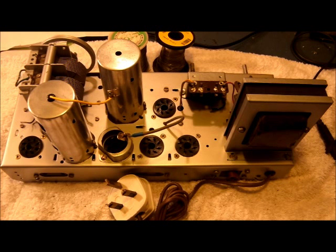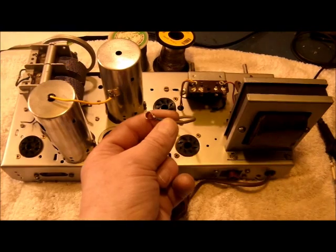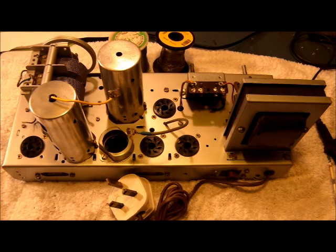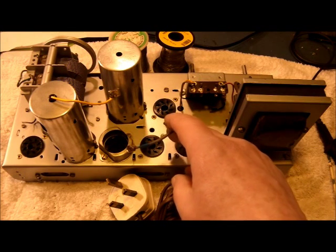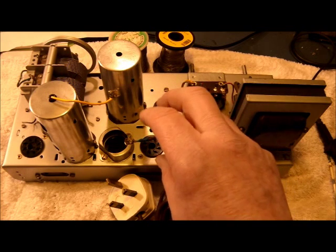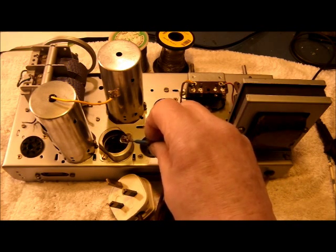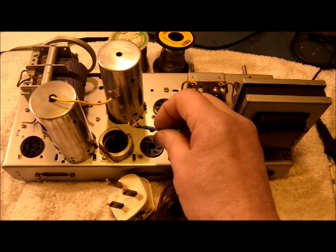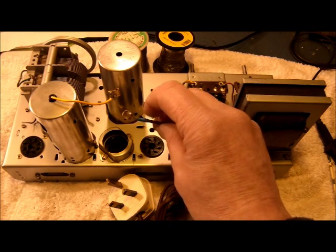Just a couple of small tips: it is essential to clean and shine valve pins and valve base connecting forks. It is also essential to clean and shine valve top caps and top cap connectors, especially internally. My other small tip is to make sure replacement screen leads are neatly trimmed — don't leave it where there is an eventual possibility of the outer wire sheathing creeping towards and touching the inner wire. I always use a little piece of heat shrink.